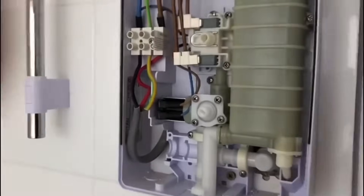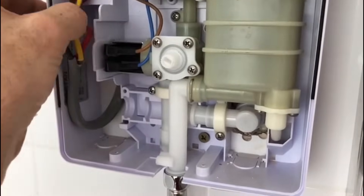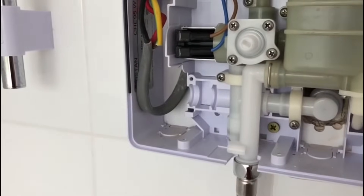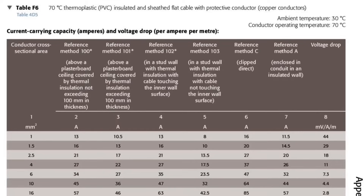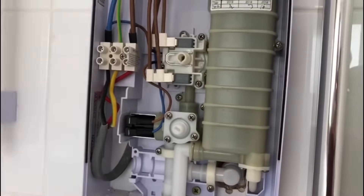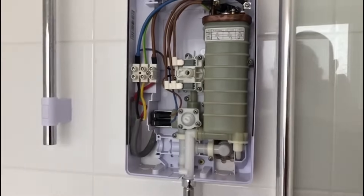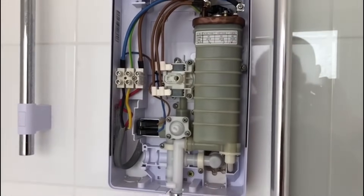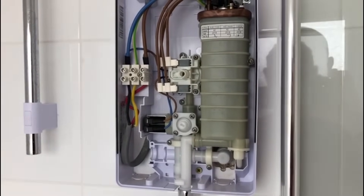So to recap: the ammeter on the neutral read about 40 amps, protected by a 40 amp circuit breaker — that part's okay. What isn't okay is the 6mm cable. Off the top of my head the maximum current a 6mm can carry is around 46 amps, but that's if it's clipped direct to the surface. This one isn't clipped — it's embedded, it's in contact with insulation, and it's a good 10 metre run. So this is another common issue with electric showers: the original 6mm cable was installed, but then the shower has been upgraded from something like a 7.2 or 8.5 kilowatt unit to a 9.5 kilowatt, and the cable hasn't been upgraded.